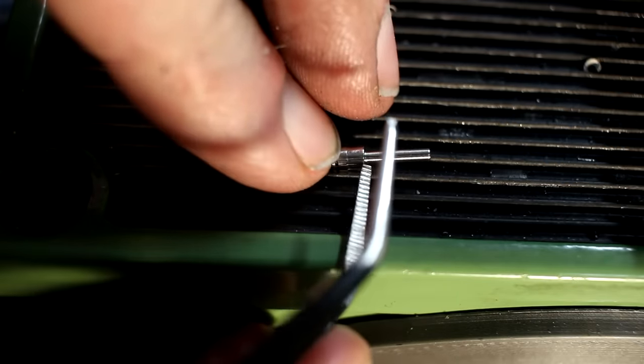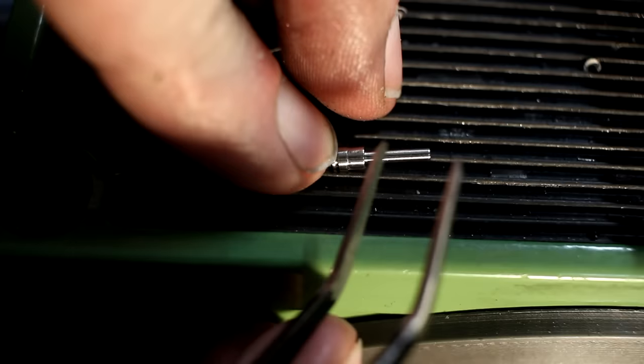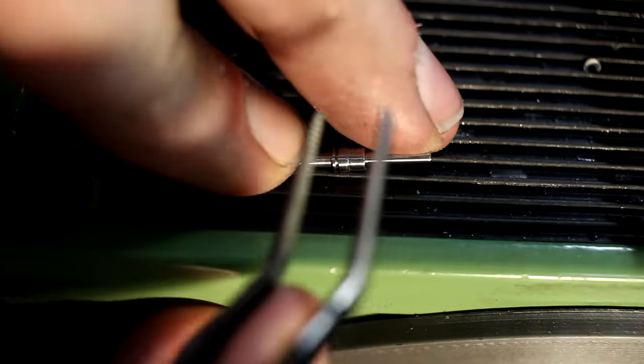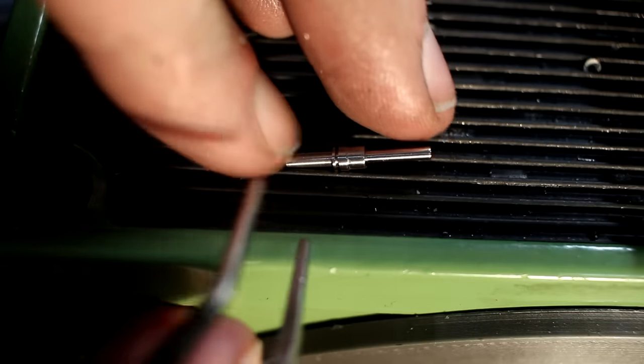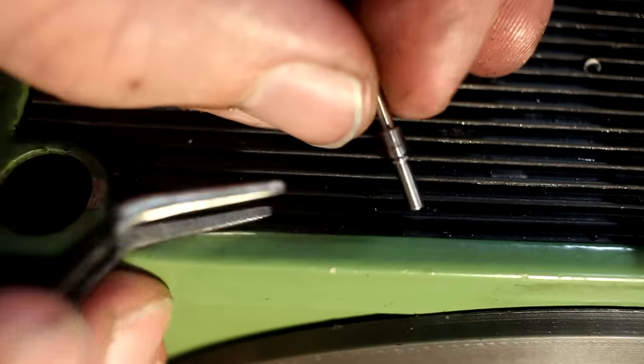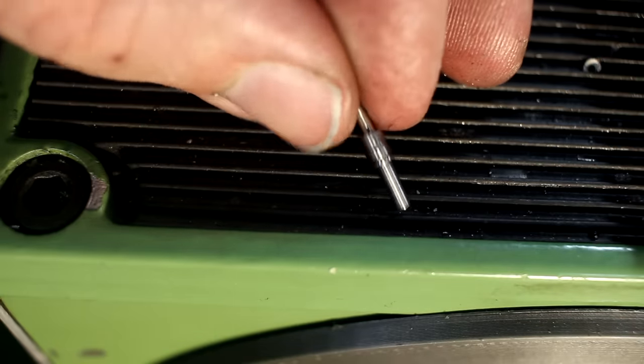When you deburr, when you break an edge with a file, you will create a secondary burr, and the Kratex rubber abrasive will take care of that. So these parts are basically done. Last step is to throw them in the tumbler.